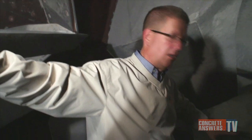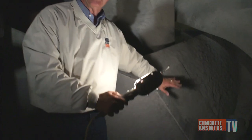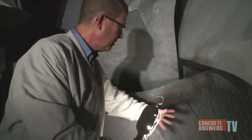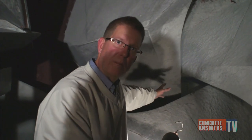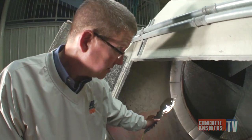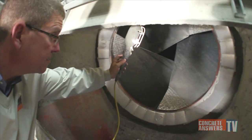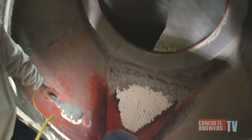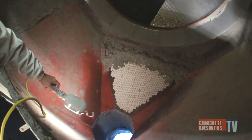We're at the discharge end of the HRM. You'll notice these three large discharge blades that scoop the concrete up and discharge it into the mixer hopper. These three discharge blades are all lined in AR, dropping into the discharge chute which charges each and every truck.